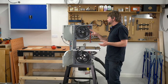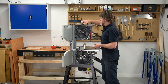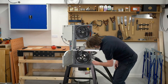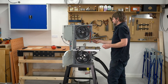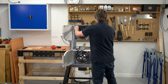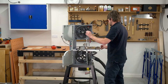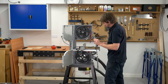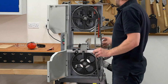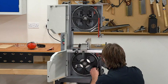We'll cut some metal now. The first thing we need to do is change the blade. I've already removed these guards — they're simply just two Allen key bolts — then undo and release the tension for the blade, remove the insert, remove the deflector plate, move these guides back with the adjustment, and simply undo the table piece and remove the blade. The blade we've chosen is a bi-metal blade with a tooth configuration of 4-6 TPI — it's an alternate tooth — and this will ensure a really clean cut in the metal.